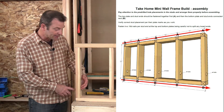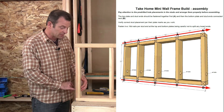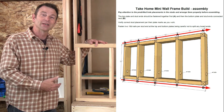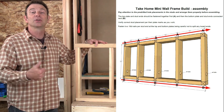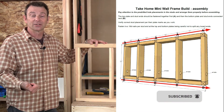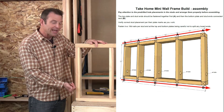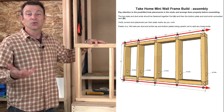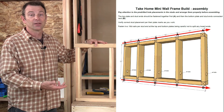I would recommend that the holes you have to drill be done before you assemble this — it will make it easier for you. You can use a spade bit and any type of electric or cordless drill. The hole should be at least a half inch to accept the 14-2 or 14-3 cable that you'll run through it.